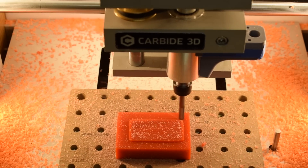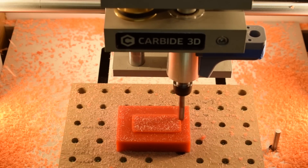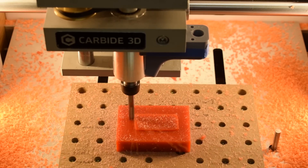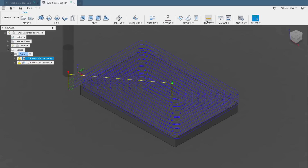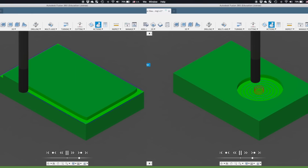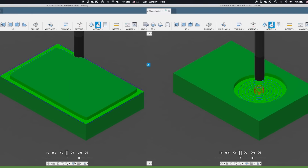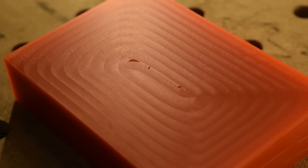Looping back to the beginning where I likened wax to chocolate: when you come up to thin features in wax, they have a tendency to snap off and fracture unevenly. Solid materials like wood or aluminum usually bend or rip off at the surface, but wax can actually pit the surface when chunks break off, so design your toolpaths to avoid this. An adaptive roughing operation that works from the inside out is a lot better than one that works from the outside in. The thin protrusions near the end of the toolpath left craters in the wax when they got ripped out.